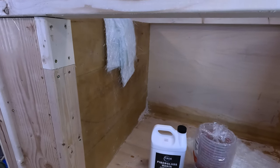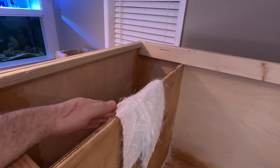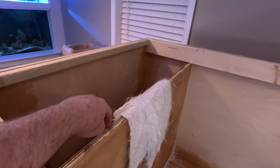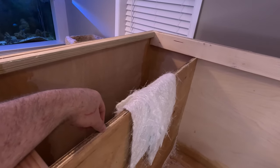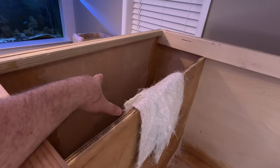But there's one thing I want to mention, is I think I misspoke in the last segment that the water would be rolling over the top of the baffle, so that's why I'd be fiberglassing it. The water won't be rolling over it. There'll be bulkheads. The water will be coming through the top, not over. But I still want to fiberglass the top of the board, because it is simply the exposed plies. That's not a good surface to waterproof. And there is going to be quite a bit of water there.